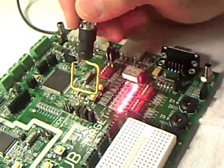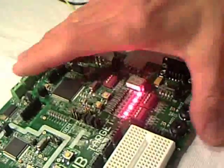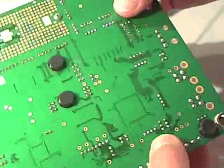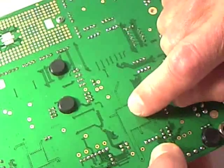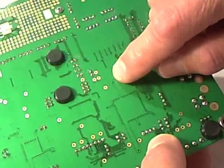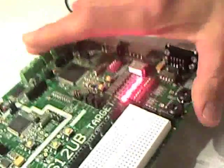This is a very handy way to find problems on boards. Now let me flip the board over. Here's the bottom of the board. This is a little hard to see, but it's a two-layer board. The bottom is mostly ground, but that reset lead comes out about where the end of my finger is and crosses this break in the ground plane, which forms a little loop in the ground return path for that signal and helps make this more of a problem.